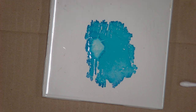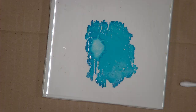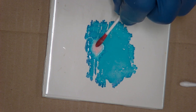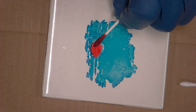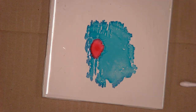I can use that solvent to draw a spot or an area on my piece — that's what I did here. I created a border, and then after I created a border I put in another color. I can now take this red and touch it in the center to color that as a highlight. The amount you put on will determine if it runs — see how it's created a purple edge right here? It allows you to mix and match and do that on your wood, as long as the wood is sealed.